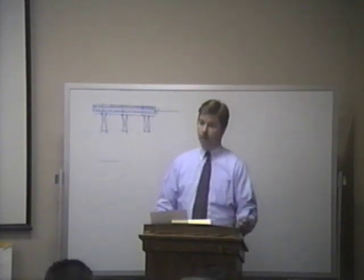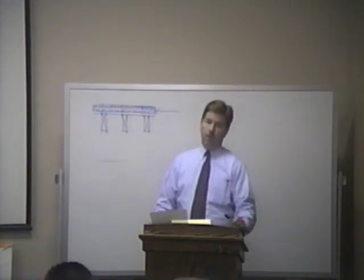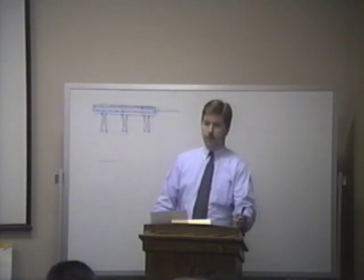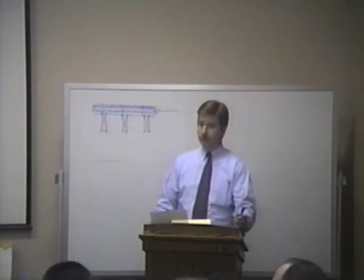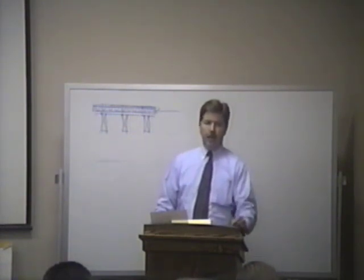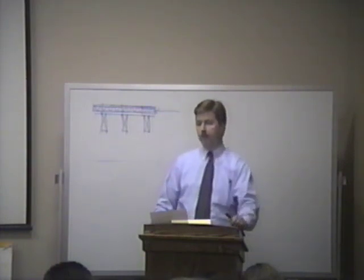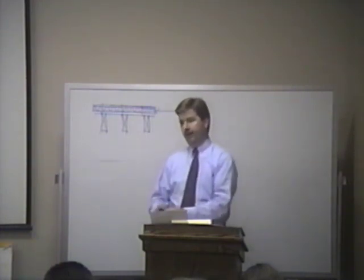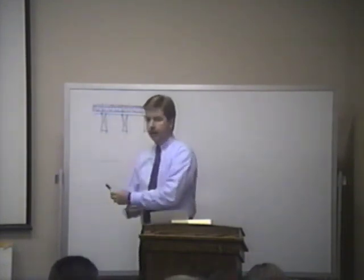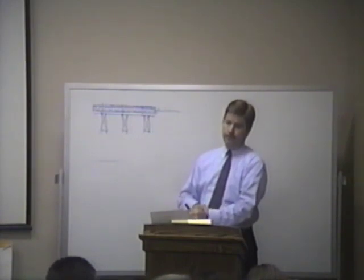So if you have poor design, coupled with poor design of the building, I wouldn't say poor design, but a design situation where the mechanical engineer is trying to deal with the architectural element he's been dealt, the cards he's been dealt, so to speak, to keep everybody happy, he has to overcompensate on that western exposure to satisfy those parameters. And unless you can afford a variable air or a multi-zone system, it's a single-zone system, whoever's on the interior pays the penalty in overkill because you're trying to satisfy that load that hits you in the afternoon.